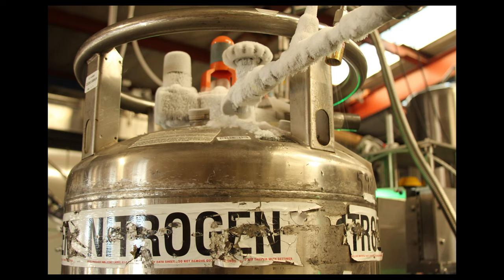How does the liquid nitrogen actually get to your unit? You would either need a bulk tank — a lot of big customers have a bulk tank outside — but most smaller customers have a liquid nitrogen Dewar, about 180 to 230 liters, sometimes on casters. You get it close to your filler, and there is a vacuum-insulated flex hose that would be attached to the Dewar and then into the doser.